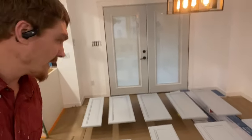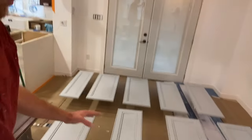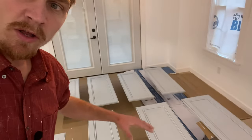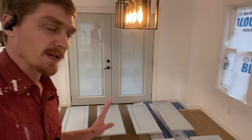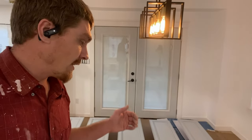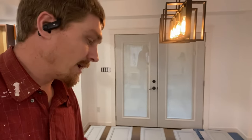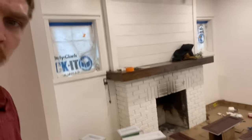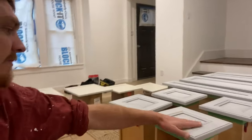This is the way I laid out my doors to brush and roll them. I wanted to be able to access all the edges and I don't like to have the doors standing up against a wall or something. This way it'll keep from running at all and you'll be able to get around to all your edges — you won't be setting a painted edge down onto the floor on a piece of cardboard or whatever. Then all my drawers, I have taped all the way around the face.